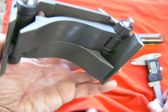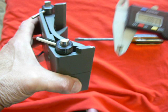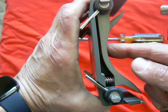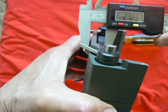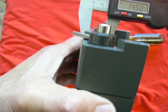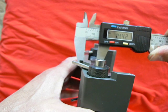The way to adjust the pump head back is to use an electronic caliper in millimeters. Measure the narrowest distance between here and here, and that should be 14.3 millimeters. This one measures 14.4, and I found that's close enough.